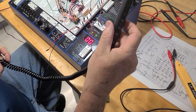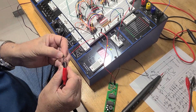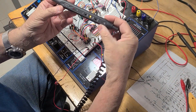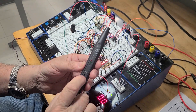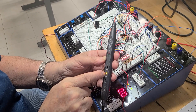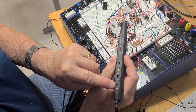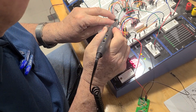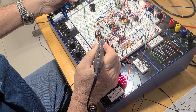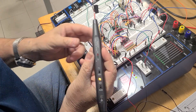Any piece of equipment, no matter how simple, needs to be energized. These probes don't depend on a battery — they take energy from the circuit you're troubleshooting, which is already energized. This third probe has the same CMOS/TTL, pulse/memory buttons, and two green and red lights for low and high. Additionally, it has a small transducer for audio indication: a lower frequency sound for low and a higher frequency for high.